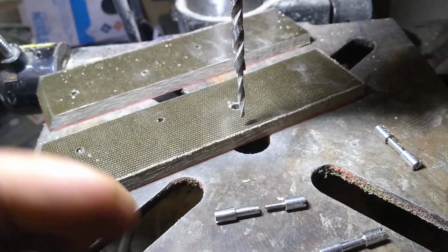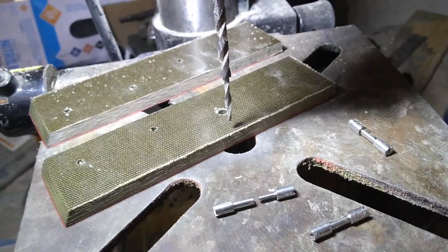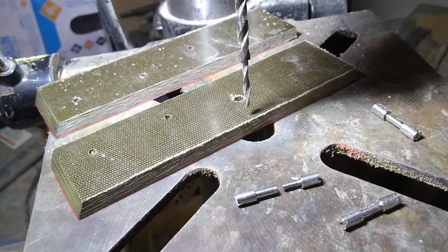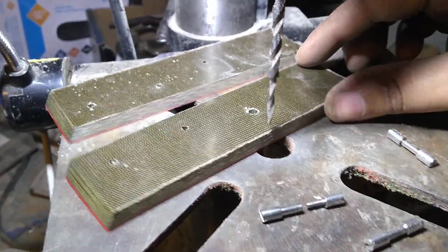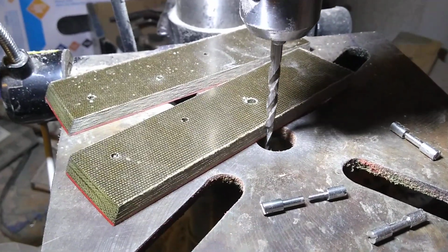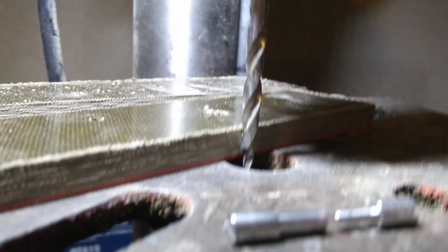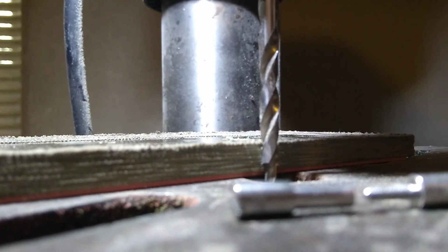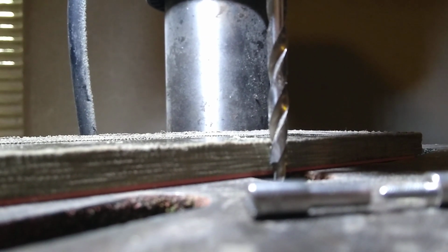It sounds pretty simple, you know, pretty straightforward, but there's a lot of details that actually go into it. There's plenty of handle scales when I was first learning how to do this that I would mess up really, really badly. And so the idea is that when you come in here, you have a stop on your drill. You can see that we have it stopped and tightened right there, and that we size it up on the side of the scale to see, okay, how far down do we want that to set? Now, we can go a little bit lower, we can go a little bit higher.